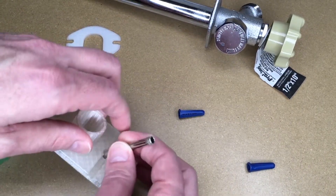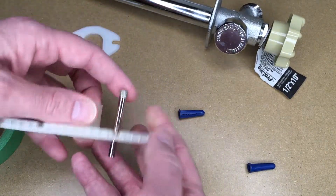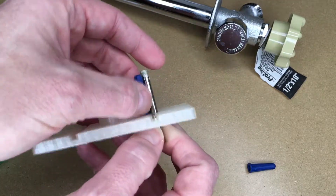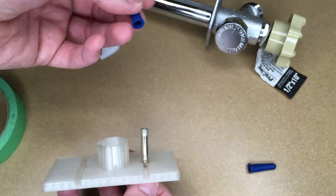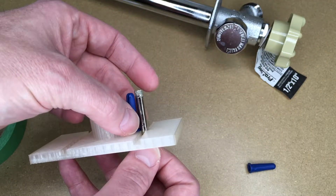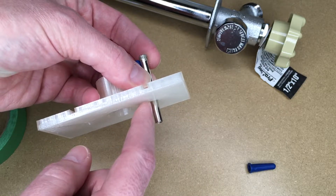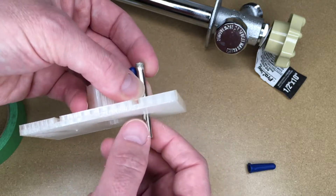So I'll stick this bit in here. There's a little bit of friction here but it fits in the shaft pretty good. This is about how far I need it to go in — I want it to go a little past this plastic anchor here. I'm going to pound this in the house once I get the hole, and then I'll use a stainless steel screw to hold the valve in place. I want this a little bit longer, so I'll mark that with a permanent marker and stick it in my drill so when my drill touches the plastic I'm in all the way.